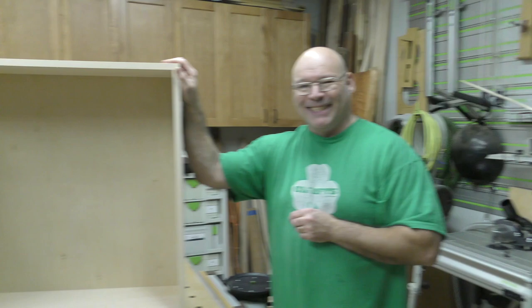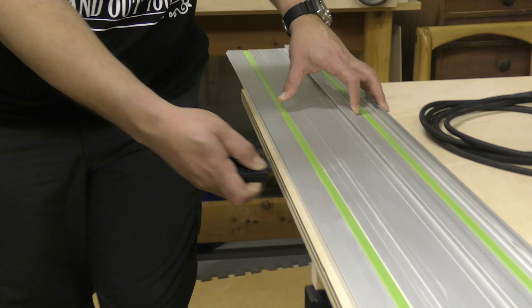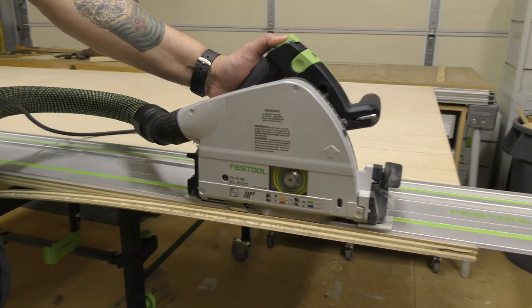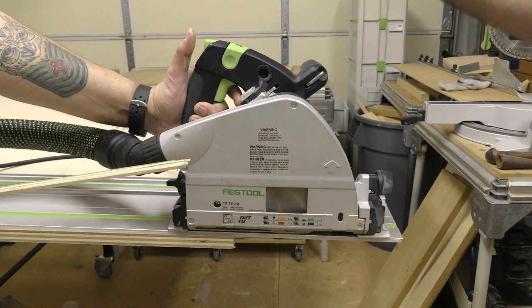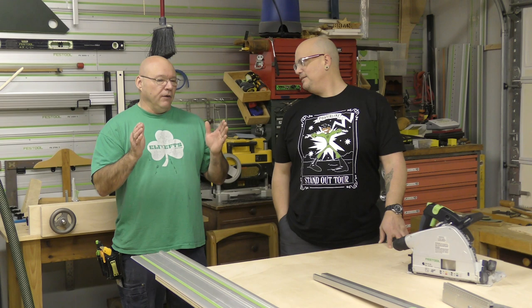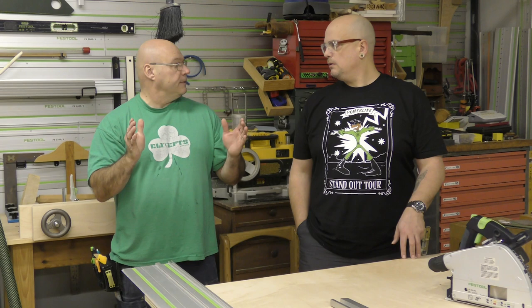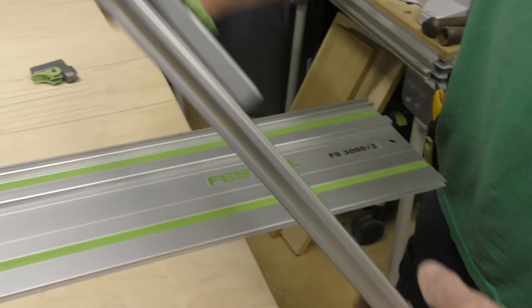What we want to do is capture the blade — set it up like that, which allows you six millimeters of cut. Bring it all the way down and back down, then lift it up at full speed. We need our 300 millimeter width — we're building a wall cabinet and we need enough plywood for four pieces: the top, bottom, and two sides. We're gonna rip them at 300 millimeters, which is roughly 12 inches.